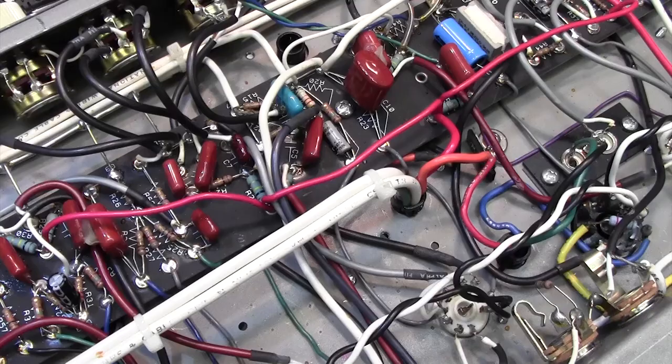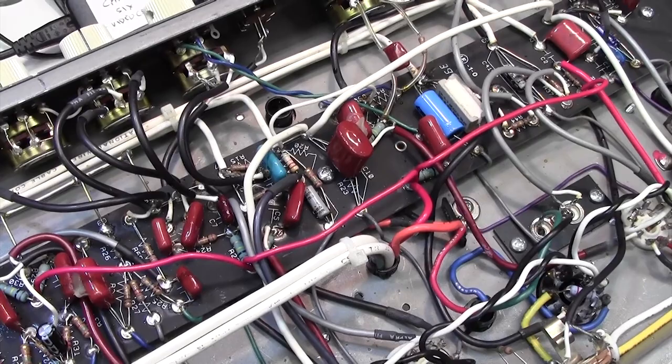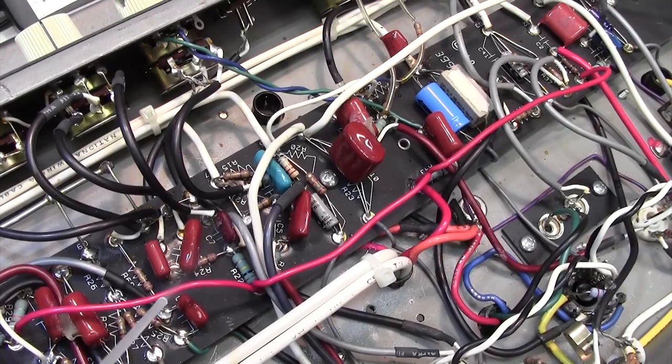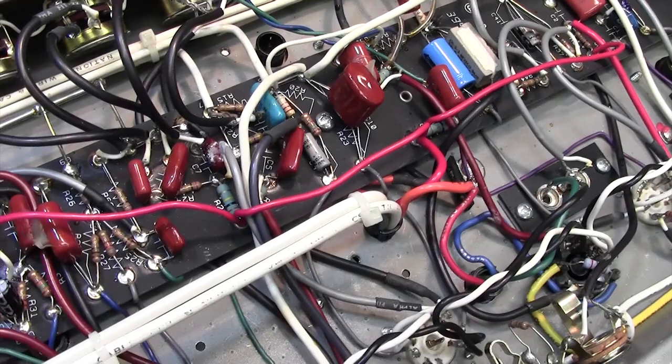And all the noise has gone completely now. I don't even know whether the amp's working, but that won't be, of course, because the valves are out. But the noise has disappeared, so nuking that with a heat gun on lowish heat has stopped that stone dead. Interesting that that's gone completely, that noise.